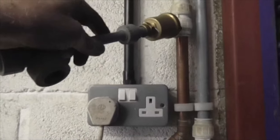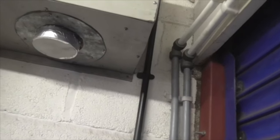Right, the heat comes up to here, it gets as far as about here and stops. And that tells me that that pipe is airlocked. Right, so if I put a bleed on there, that should let it out. Let's strip it down and give it a try, for Christ's sake. Let's have this fixed.